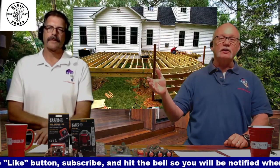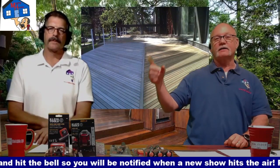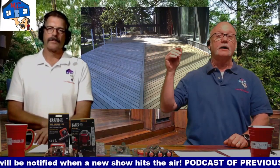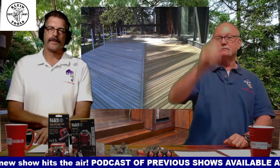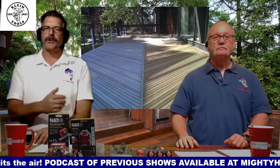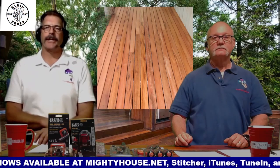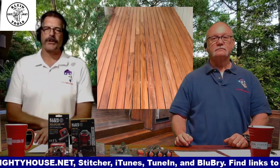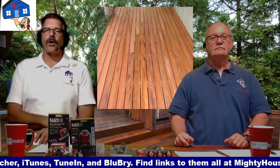What you used to see a long time ago, everybody just threw down some 2x4s. You can do a standard 2x4 deck — you put them down, took your nail gun and went bang bang bang shooting those deck boards down. Same thing with 2x6. What made 2x4 and 2x6 decking great is that you could put your joists on two-foot centers, because as a 2-inch nominal material it could span 24 inches no problem. However, cost of lumber has increased, so 2xs have become kind of cost-ineffective.